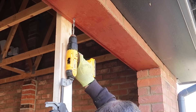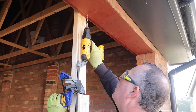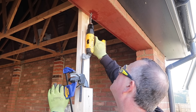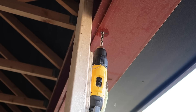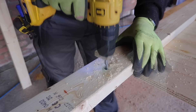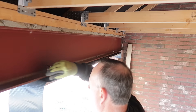After a couple of successful holes I was getting quicker and more proficient, so I brought in version two — instead of holding the clamp continuously to exert the required pressure, I used another clamp. This two-clamp technique was even easier on the hands and I could have continued indefinitely. Drilling steel like this, especially when it's above your head, it's absolutely imperative to wear eye protection — these little metal chips go absolutely everywhere. If I had more holes to drill, my version three would be to buy a cheap scissor jack, the type sold on Amazon for changing a wheel on a car, which would make it even easier to exert continuous pressure.